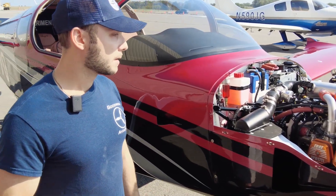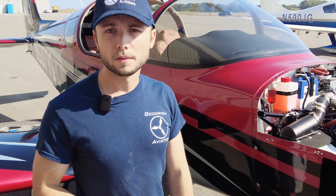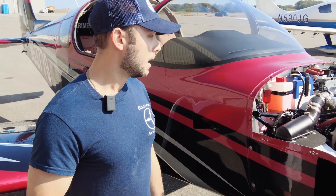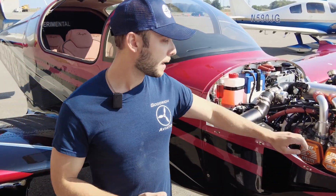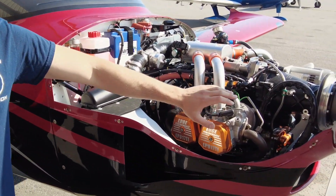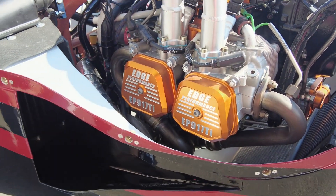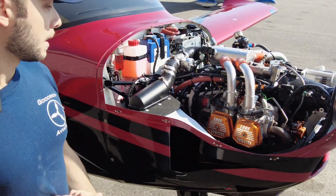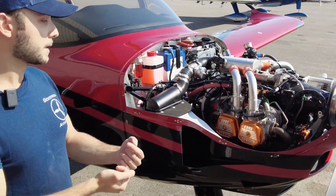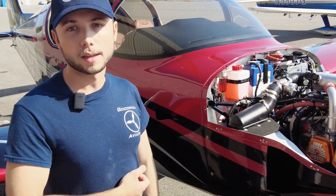If we're good, then I'll continue. I'll start it again and we'll run it for four or five minutes. We won't get above about 2,500 RPM. Then we need to shut it down and, per the Rotax maintenance manual, we need to inspect the lifters on the inside of the engine. So we'll pop the rocker covers off and make sure there's no air trapped in them. I'll do that by leaning on the lifter when the push rods are at full extent — I'll lean on with a hammer and make sure they're not really squishy. If they're really squishy, that indicates there's air in them.